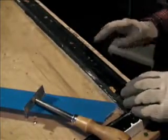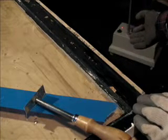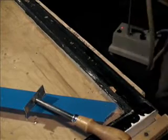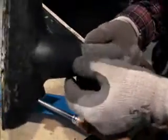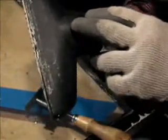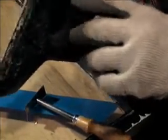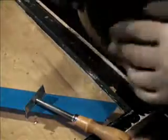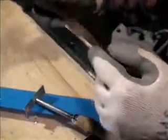And I'm softening up the paint with the steamer. Right down here on the floor is my portable steaming unit, and that has a hose coming out of it, and the hose is connected to a steam head. I make these steam heads custom shaped out of vacuum system parts. This is a vacuum head, and I make a steam nozzle out of it. So a little bit of steam is coming out of there. It's not a blast of steam, just a slight amount.